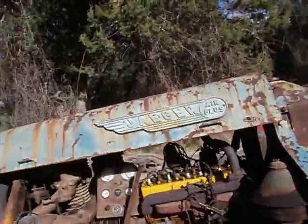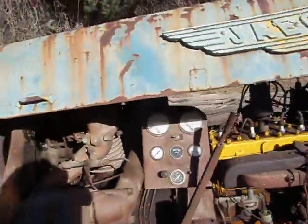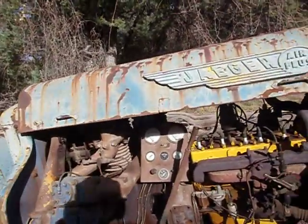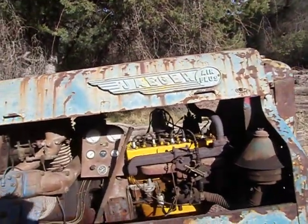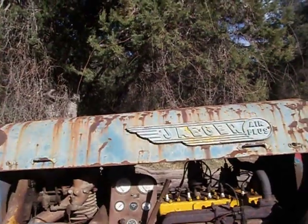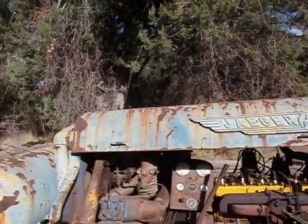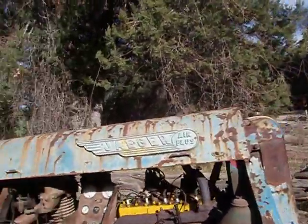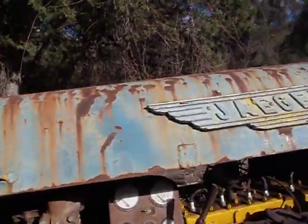Away it goes. And you let it warm up here a little bit. I notice that the 8-volt battery was real good — actually a little too good; it cooks the water out. But that battery's no good anymore anyway, it won't crank on the 8. So now I just charge the 12-volt up every once in a while. When a 6-volt starter is cranked on 12-volt, even at idle, it really winds them over. So you just don't want to get too heavy on the switch.